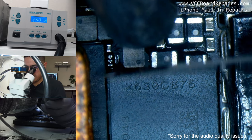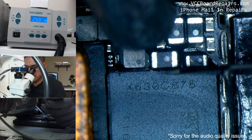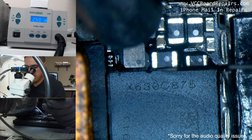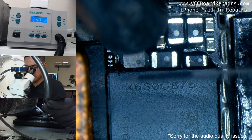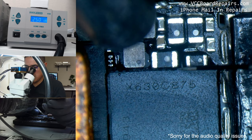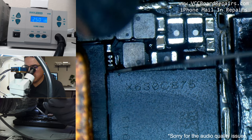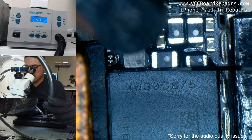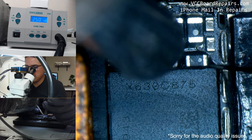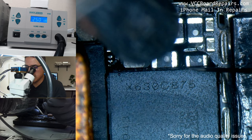I'm using a lower temperature of 250°C so this is not risky to the CPU. I'm still using the copper shims to protect it. What the copper shims do is make the CPU larger in a thermal sense — the copper shims absorb that heat and disperse it away from the solder balls of the chip. You can also use a coin or anything metal that absorbs heat.